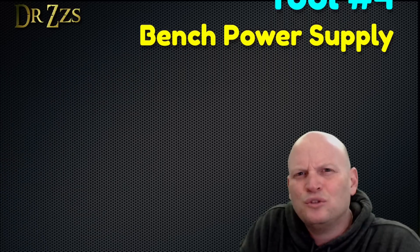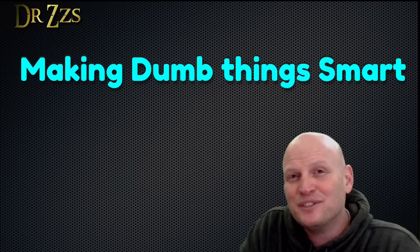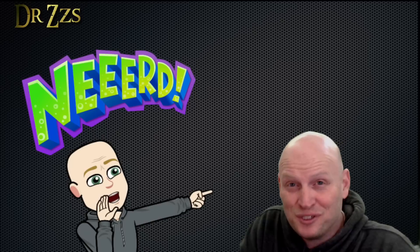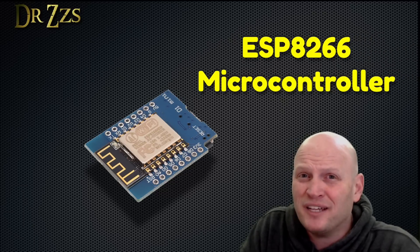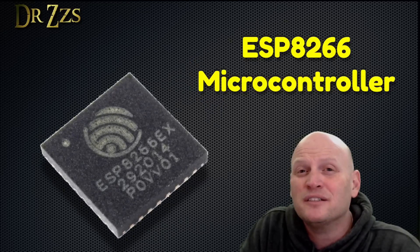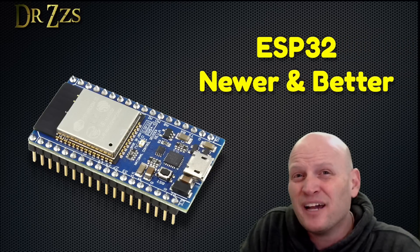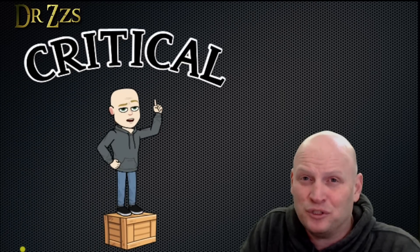So those are some of the principles and tools that I use in taking things apart. Now, what are some of the specifics about making normal dumb devices into smart home devices? It's time for some electronics magic. Number one is the ESP microcontroller. The ESP8266 has been the main microcontroller in just about every smart home device for at least the past five years. It's cheap, it has WiFi, and there are plenty of ways to program it. The ESP32 is the newer, more powerful version. If you want to DIY some smart home devices, you absolutely must become familiar with the ESP microcontrollers.